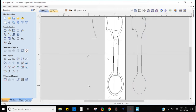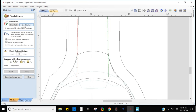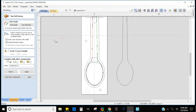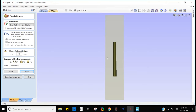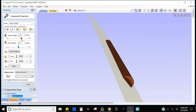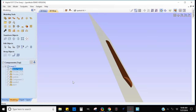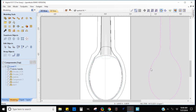The actual Sporktula shape is there, and I use the Offset and Layout tool to create a border about a quarter of an inch larger than the shape — that's what I use to set my tool path for my 3D roughing and finishing, so I know I go beyond the shape. To create the handle I did a basic two-rail sweep from the modeling tools. I have two lines running down the handle section and I created a half circle to apply to the two-rail sweep. I could have gone into the clip art menu and found pre-made dowels or circles from Vectric, but I wanted to tweak the shape, so I created my own and manipulated it the way I wanted.